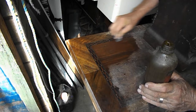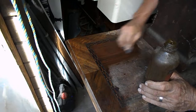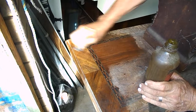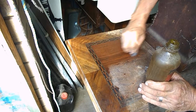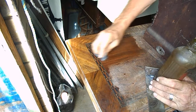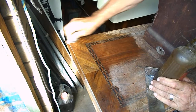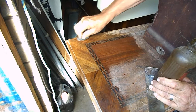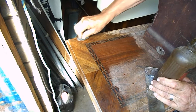You can see how little pale boiled oil I'm using to do the job — I'm not saturating it. One thing you may notice, with this short period of time, is because the wood is so old and dry, the pale boiled oil is soaking straight into the timber. That's exceptionally good, because the pale boiled oil will soak in and condition the veneer, and the stuff that sits on the outside will sit there and harden like a lacquer.